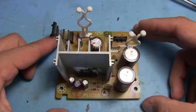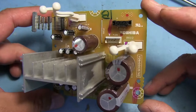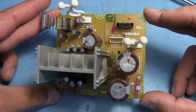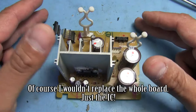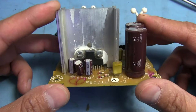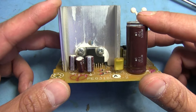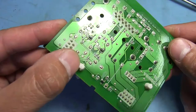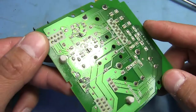All it has on here is just the basics for what the audio amplifier requires. This amplifier is actually a TA8216H — it says it's 13 watts per channel at a VCC of 28 volts. This is our audio input — we've got some grounds, audio input running in here, going through some caps, and that runs off into the inputs on the actual IC itself. The power comes into here, and looking at the bottom we see our power traces coming in — this is actually the filtering cap for the power coming into the amplifier.